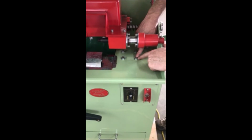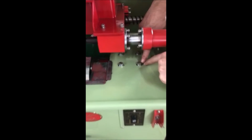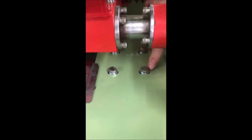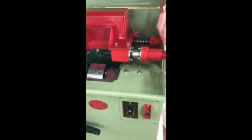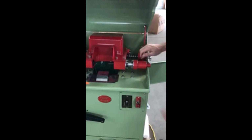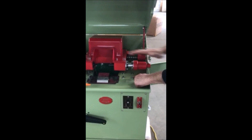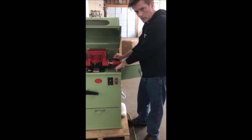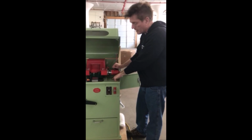You'll also note underneath here, there is a washer that is a shim underneath the deck. You want to keep that shim. That's underneath here. There's a shim because that arbor angle can change. So this is shimmed underneath there to have the arbor be straight. So you want to make sure that you do not remove those washers that are on top of the arbor.